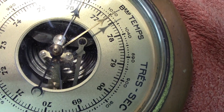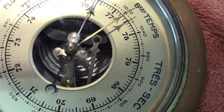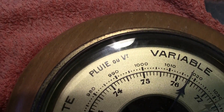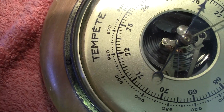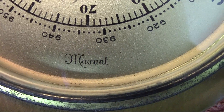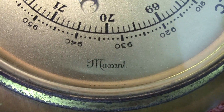The position of the vacuum box depends solely on the air pressure which is pressing all around us all the time. Bad weather normally means less pressure — you can see the scale here, the bad weather side is in French because this is actually a French barometer.